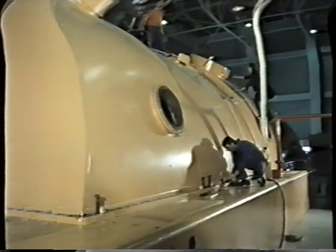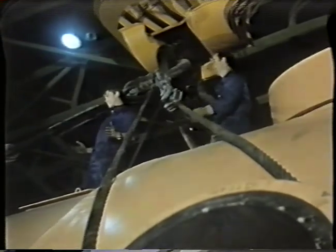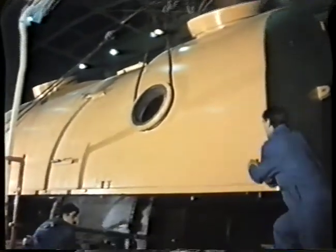The low pressure upper part of the turbine is dismantled, following the stopping and cooling of the turboset, to facilitate the detailed inspection of the turbine internal parts and bladings.